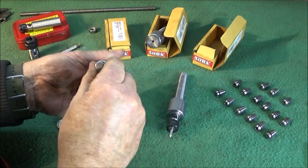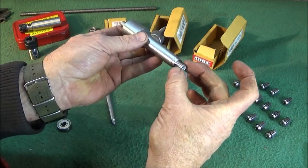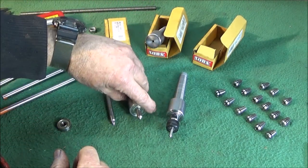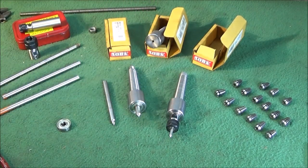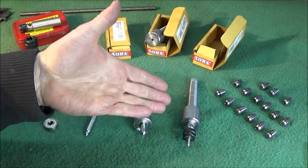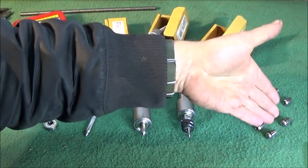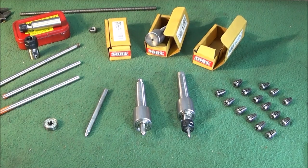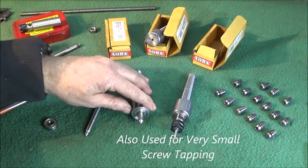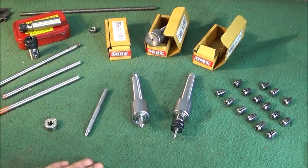And I don't know whether I mentioned it earlier, but the soft arbors already come with this 3/8 thread in there, so there's no need to actually drill and tap them. So I hope you see what a great versatile tool this is, and with the ER11 collet chuck, you have many different size collets you can put into it, and you'll see that this is a very useful tool to have. I have another tool coming up in a future video,